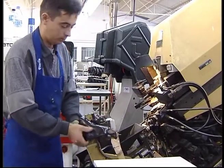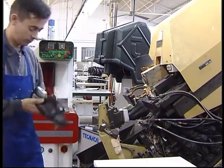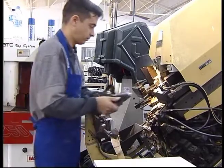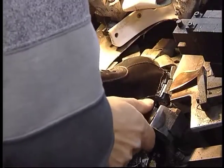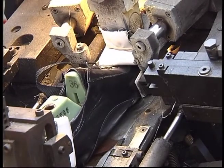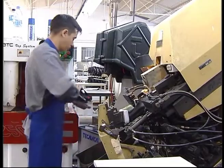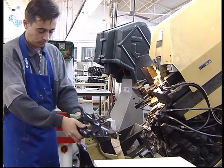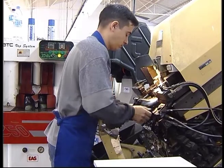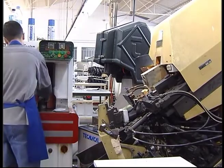Toes assembly. This operation nowadays is made mechanically. The upper is placed on the last and positioned in the pulling and lasting machine so that the operation is executed. It is necessary that the employee positions correctly the upper on the last and, whenever possible, uses the optical accessory that helps to center the toe. The toe should be sealed to the last and the lines of the shoe should be well positioned. Usually this operation is preceded by a reactivation of the toe area. Depending on the type of skin, the upper can be reactivated through humidification or only through heat.